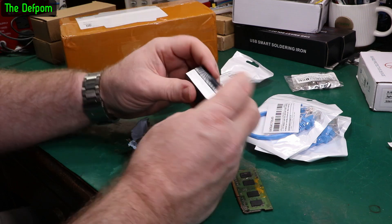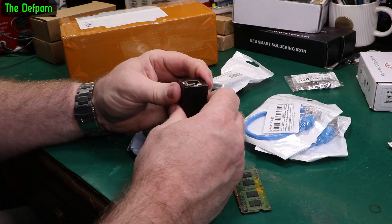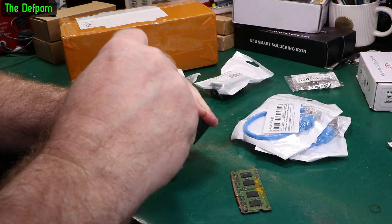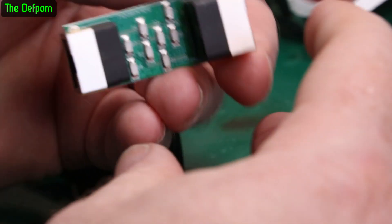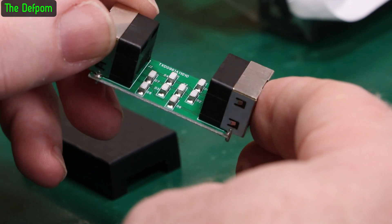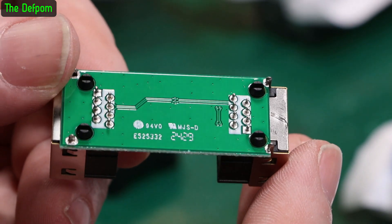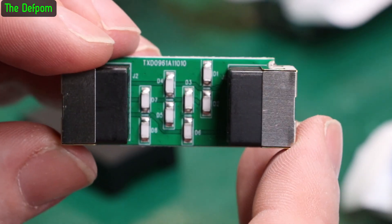What does it claim? Lightning surge protection. There's no external connection so it doesn't have a ground point - that's the first thing. Let's see if we can get a spudger in here and force it open, see what's actually inside. It's got a bunch of markings for diodes, though they look suspiciously like capacitors. Soldering's definitely a bit on the dodgy side - look at that.